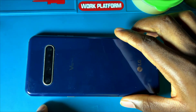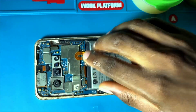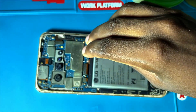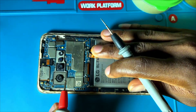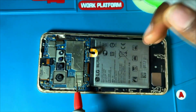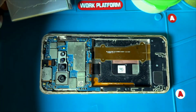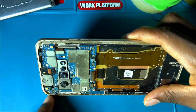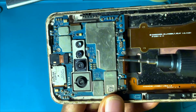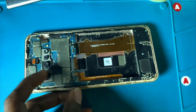I'm Sergis Mike. In this video I'm going to show you how I solved a power problem on this LG mobile phone that has been down for almost two years in another repairing shop. I tested with my multimeter in diode mode and saw a very low reading in the battery connector, so I quickly knew there is a short circuit in the mobile PCB — not a full short, but a half short in the VBAT line.